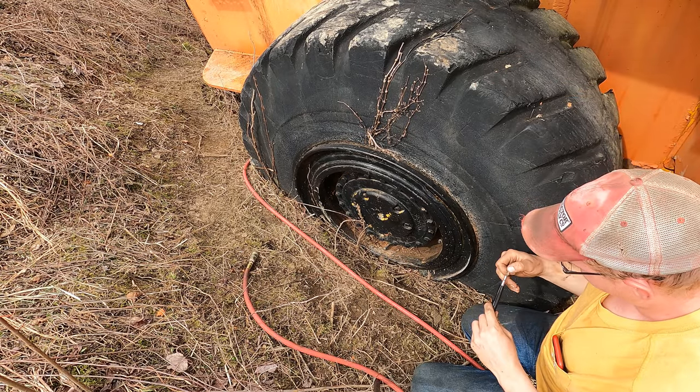I'm gonna go ahead and try to crank this thing up now. Like I said, I replaced that fuel line, so there was a big air bubble in the line. I did pressurize the tank and crack a fitting and bleed out as much as I could. Hopefully it doesn't give us too much trouble getting started. It didn't the last time, so knock on wood.